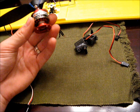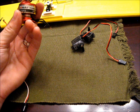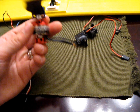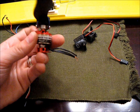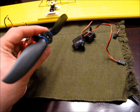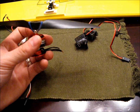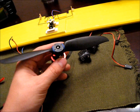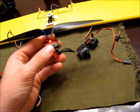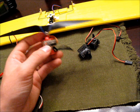It's a pretty powerful little motor. I like that it has an integral mount with set screws — you loosen them and pull the mount off, then attach the base and it makes life easy. You'll want to get a prop saver — that little silver doohickey with the two screws on either side, about a couple bucks. The motor is probably $8. The prop is an 8x4 — it recommends up to 7-inch props, but the performance is like night and day between a 7x4 and an 8x4. This thing seems to just barely run warm with it, so it's not a big deal. Worst case you burn it up — another $8 later.